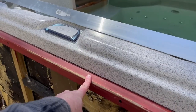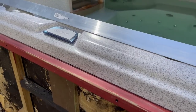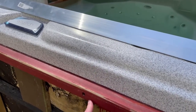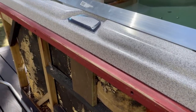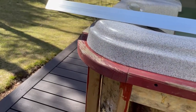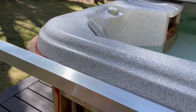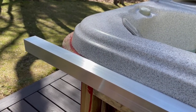This wooden top rail, which is about a one by one, will remain and that bothers me - I don't want to worry about maintaining a finish or it rotting out in the future. My solution is to install some L channel that covers the top and the front side, which is easy on the straightaways. But once you get to the corners it gets a little challenging. This piece is a two by two piece of aluminum that I'll cut down a bit to make it fit better.